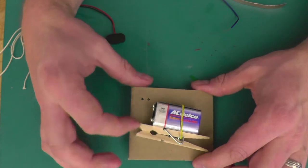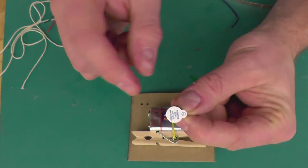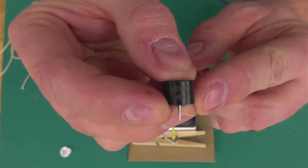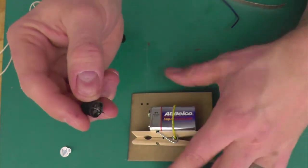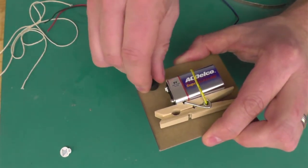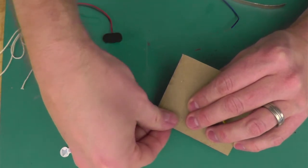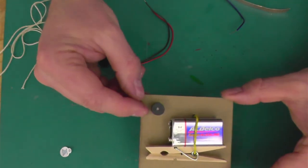Our next thing is to attach our buzzer. The buzzer has a little protective cover — just peel that off, you won't need it. Take a look at the buzzer itself: there is a small plus marked on one of the prongs. It's the longer prong if you're using our kit. Let's put the longer prong — the positive side — towards the outside of our project board. Then hold on to that, flip your board around, and bend those two prongs down. Be careful, they could be kind of sharp. The plus should be on the outside of your project board — keep that in mind, otherwise this won't work.